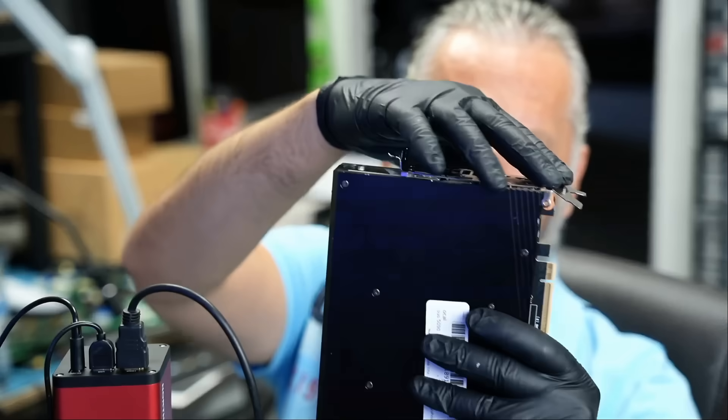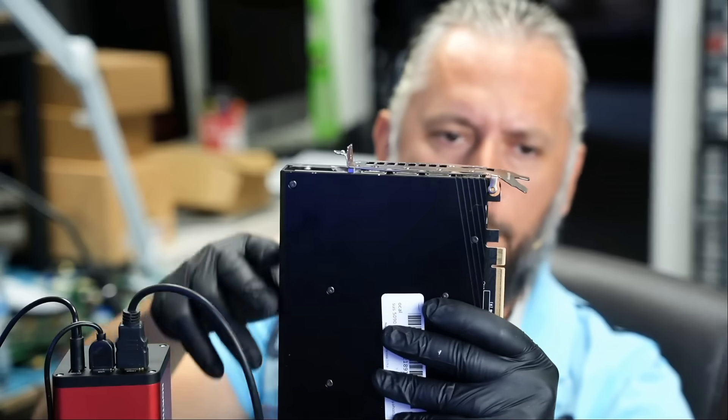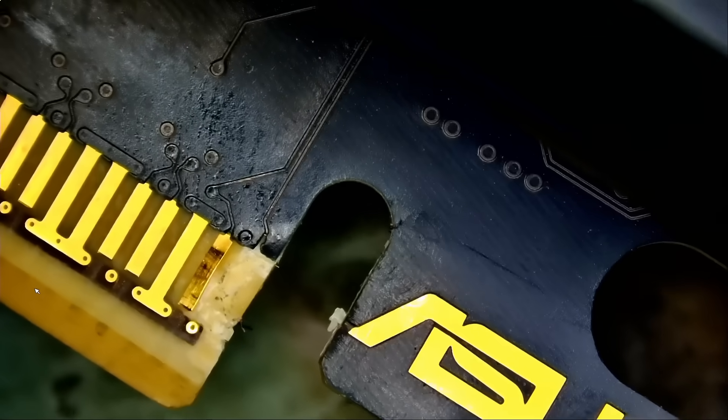The customer said to check the PCIe connector and also mentioned that the plate broke off. You can see how the inserts are bent. I told him this may be cosmetic — it may not affect the functionality of the card unless the plate is shoved deep inside and damaged some components. But right now we did not take the housing off or the water block off. I do however see with the naked eye damage on the PCIe connector. I told him we'll do our best — I do not know what type of damage we are looking at and I do not know if we have a cracked PCIe connector.